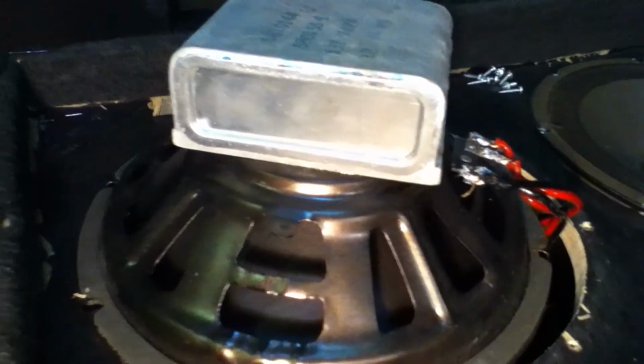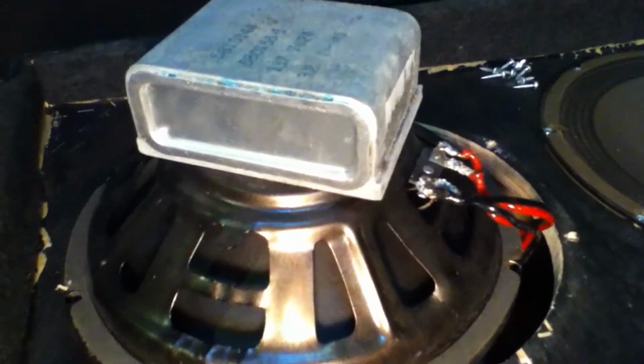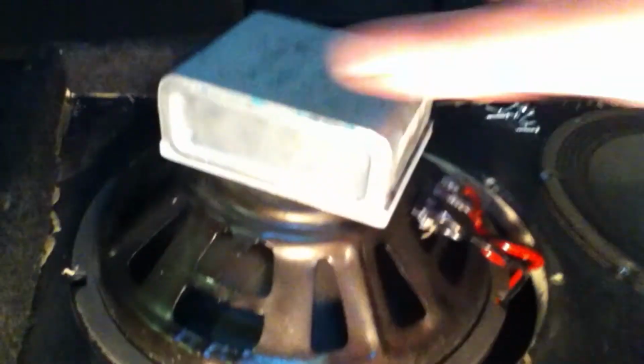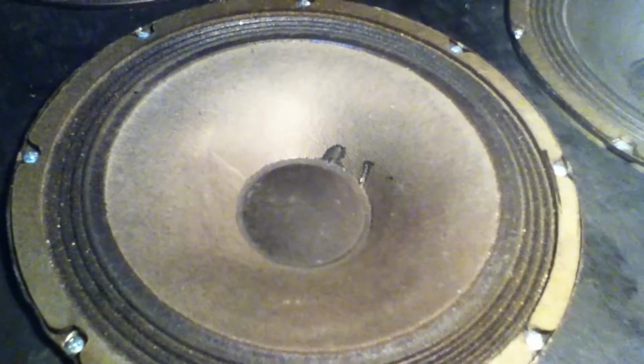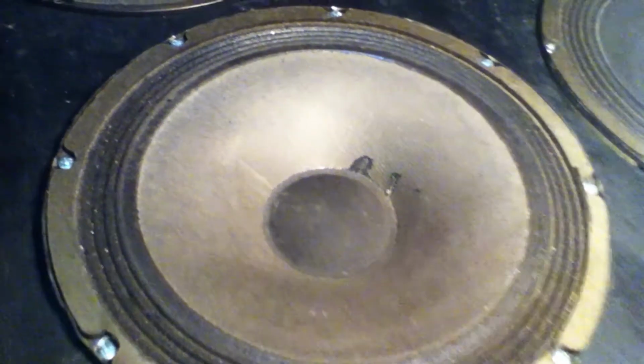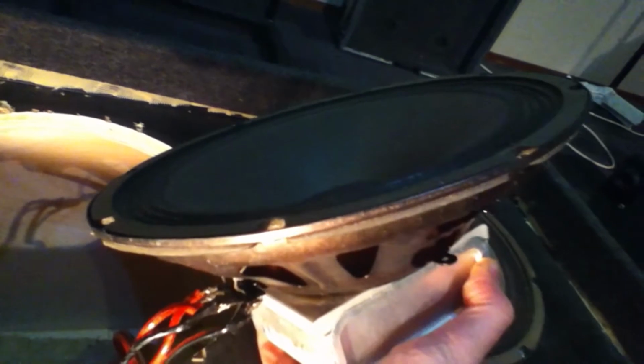The gasket is nice and brown. I'll show you the front. I can show you another speaker, of course. From the outside, I don't see any difference with the later Eminence ceramic speakers, so you really have to open the cabinet to see what's in there. The same voice coil, 2-inch. The speaker itself is a bit lighter, like 2.6 kilos, that will be 5 pounds. So the ceramic ones are like 3.1 kilos, that's like 6.5 pounds, I guess.